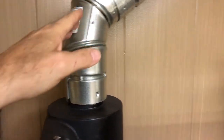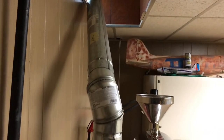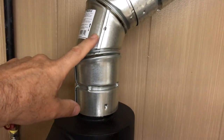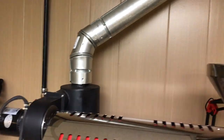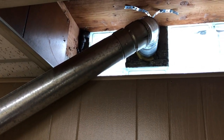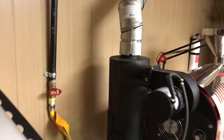I'm using Selkirk three-inch B-vent. It has a swivel adjustment here and here, so if you look at the way this is pitched, you'll see the pipe actually goes to the left — that's why you want to have these extra turns in here. That's standard for like a 45-degree elbow; it should have a couple of swivel points. It's quite a bit less expensive than some of the really expensive venting systems other people are using. I just didn't have the money for those and thought I could do fine with this system.